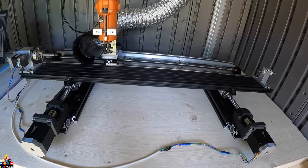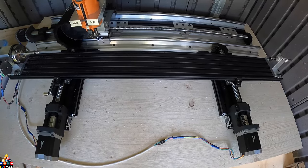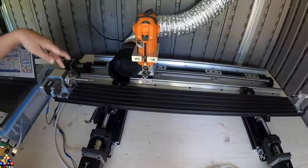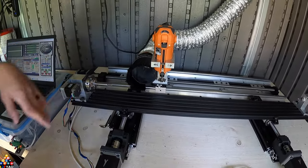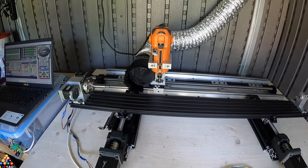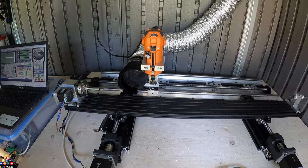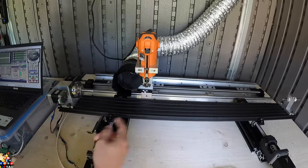Going positive is going towards the cutter; going away from the cutter is negative. I had it the other way around — X-axis and Z-axis like how a lathe is set up. Since this is technically a lathe setup, I didn't like using Mach 3 lathe. I like Mach 3 mill because I can do my adjustments a lot easier.